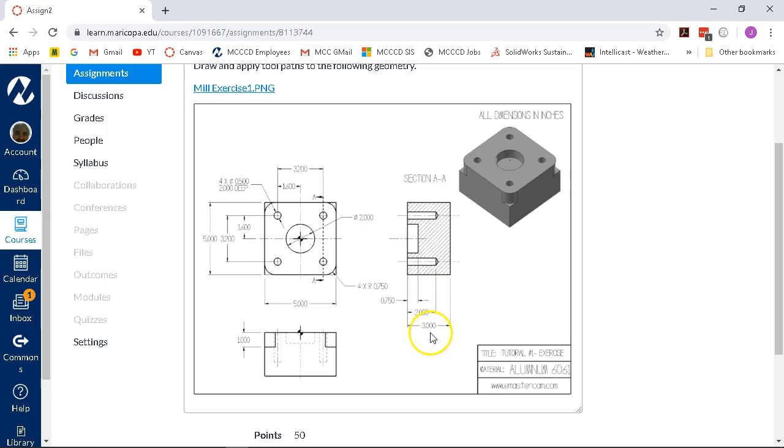Because once we get large enough, I look at the material order and I can see that I'm probably not going to find a 3 1/4. I'm probably going to have to jump right up to a 3 1/2. And then, at that point, wow, I'm taking a lot of sacrificial material off of the bottom of this. So we have those decisions we have to make. At 5 inches, even with a 2.5 or 3-inch face mill or fly cut, I'm going to have to go back and forth across this, at least make 2 passes over it to clean up the whole surface.